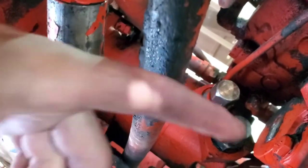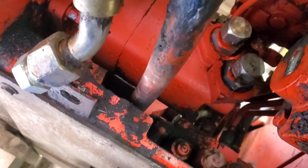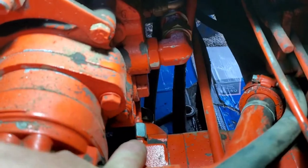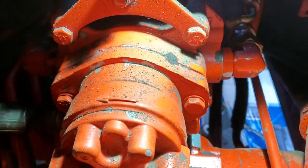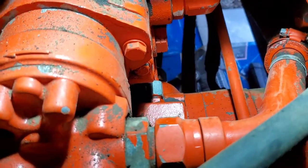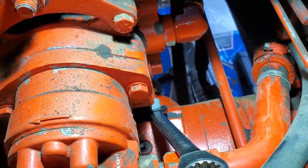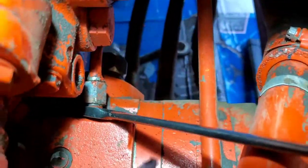There's one more fitting up top — the drain line on the front motor has easier access from up top. The rear motor drain line is on the bottom. It looks like a 9/16 but it turned out to be 11/16 — kind of a weird size. On mine I had to get a second wrench in because the ORB fitting below was spinning, and there's not a lot of room to work in there.